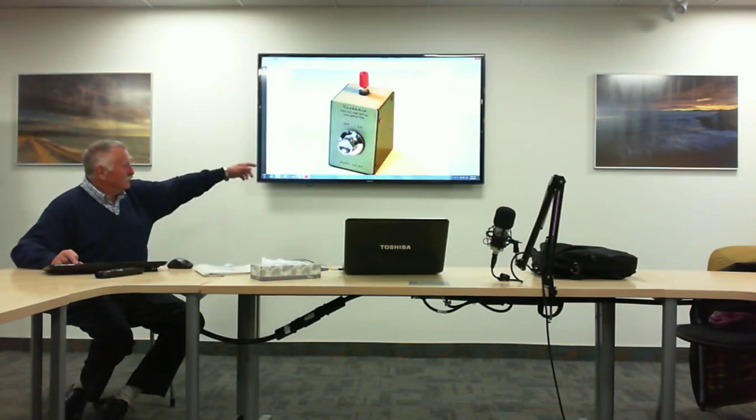It was 100 kilohertz, at the time they called it kilocycles. The 100 kilohertz calibrator, they put a little signal up into a piece of wire you attach to the post, and that would radiate across the room or across your house, would be picked up by your rooftop antenna, and then you could calibrate the analog or the digital display of your radio by turning this calibrator on and off.